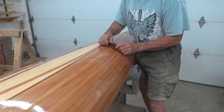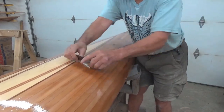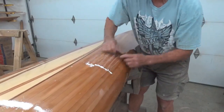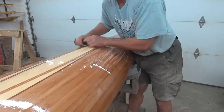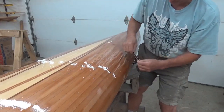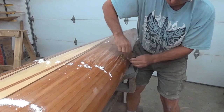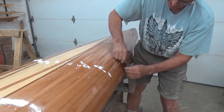We'll take it to the boat and use that little burred edge as a scraper. I could just sand this whole boat, but that's noisy and dusty and this will take off a lot more material a lot faster. You find the right angle and it will shave off the high spots — you can either push it or pull it. If you do find one of those runs, go with the run in the direction, because going over the top of it is not going to knock it down that fast.